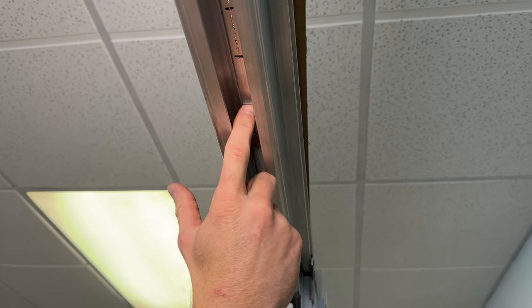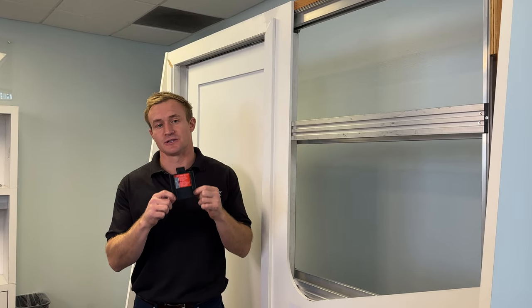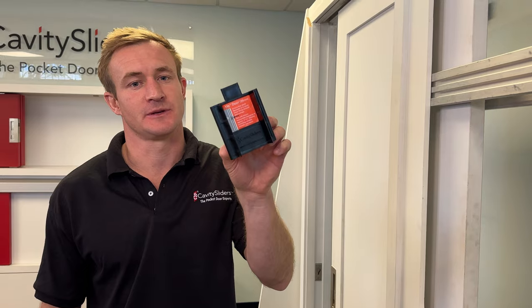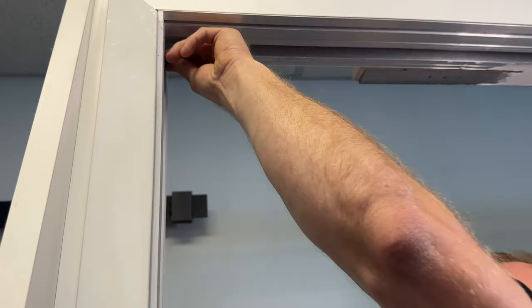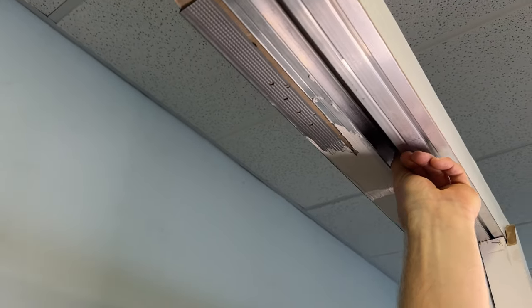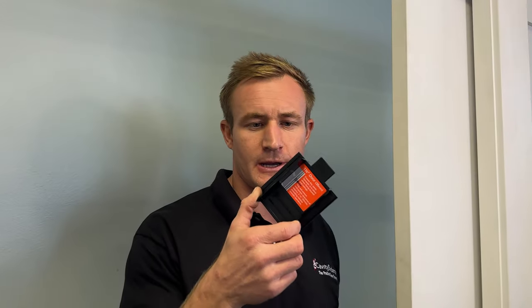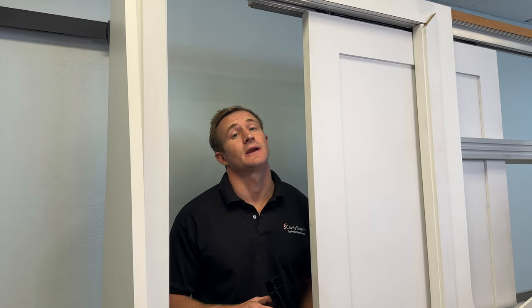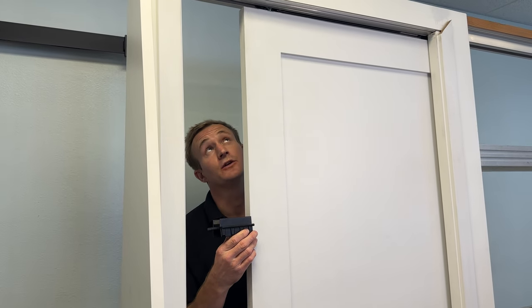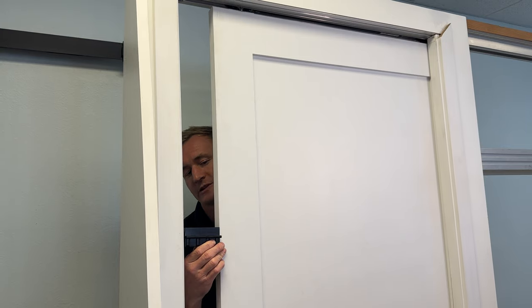You can now move the activator back towards the middle of the opening. To set your activator positions, you will be using the jam spreader or the activator setting block. The activator setting block determines the position of the activator with respect to the back stud. We now install our front activator and push it towards the middle of the opening. You will hear the mechanism pick up the activator.